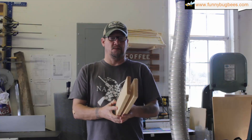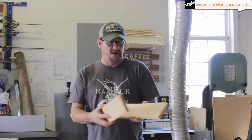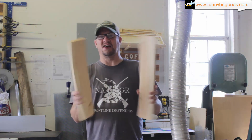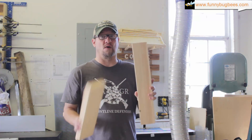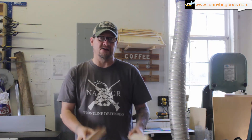This project can be made from scrap, which is what we'll be doing. You're going to need two pieces of lumber the width of whatever size hive you're using — for 8-frame, 13 and 3/4 inches; for 10-frame, 16 and 1/4 inches. You'll also need two other pieces of scrap at least 19 and 1/2 inches long, trimmed to a final dimension of 19 and 1/8 inches. All four pieces need to be at least 3 inches across the face, as we'll trim them down to 3 inches. The sizes will be in the description.